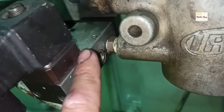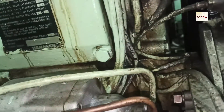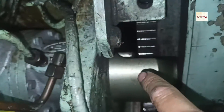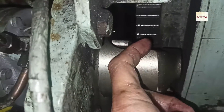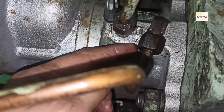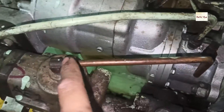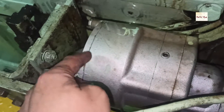The air will come to the solenoid, then the air will push to this side. The air will push the pinion. After it starts, this air will push the pinion to engage on the flywheel. When the pinion engages on the flywheel, there is a connection of the air inside here, so the air will pass on this side — the air that comes from here will pass on this side to push the piston of this relay valve, and this relay valve will open.